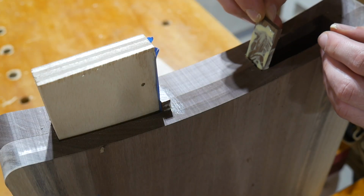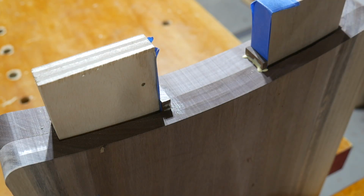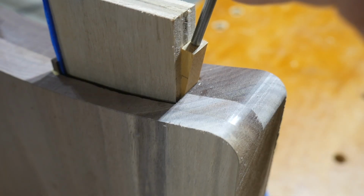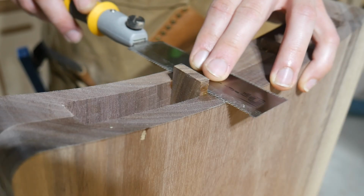Here, in this case, adapting for the too wide of a mortise that I made, these wedges go in, and then really by the time I flush trim them, you can't even tell they're there in the final piece. So worked out really well, and I'm using these little wedges here to really clamp that and get the seam really flawless.